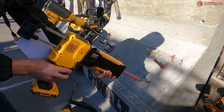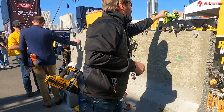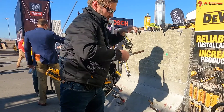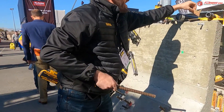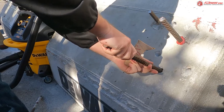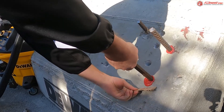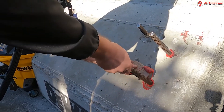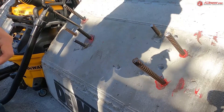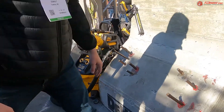When you're about two-thirds through the hole, you want to stop. Grab your rebar and a piece of cardboard to clean it up. As you install the rebar, you want to twist — make sure there's no air pockets. Clean up the excess, and it'll cure for you. It'll push gel, then cure. And that bond ultimately ends up being stronger than the material you're embedding it within.